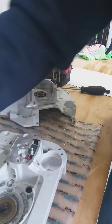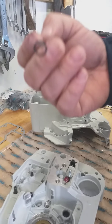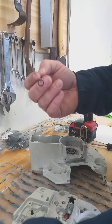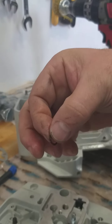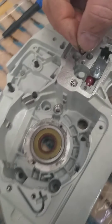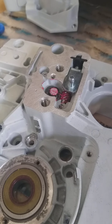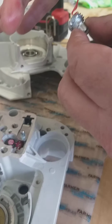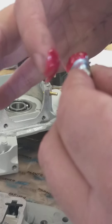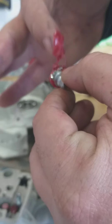There's my little screwdriver. You'll see an O-ring that's in the kit - it's just fallen in there. We're just going to put a little bit of grease on that O-ring. The O-ring sits down over the top of this thing. You can see there's a groove in there - that's where the O-ring will end up bedding in. We're going to put a little bit of grease on the gears and in that groove. Not a lot, because you'll end up hydraulically fracturing the aluminium part and you don't want to do that. Just a little bit.